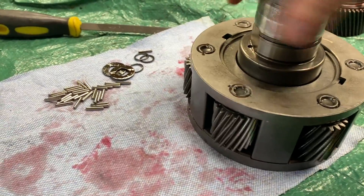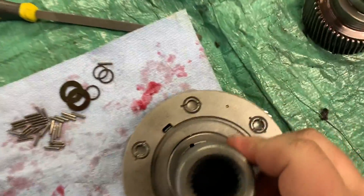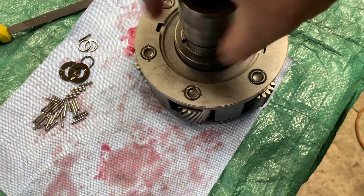And there we have it - a six-gear planetary, all built. That was pretty simple. A six-gear planetary can handle a lot more torque than your stock three-gear planetary. So if you have accessibility to another planetary or transfer case where you can salvage parts and you have a press, follow along these steps and you'll be able to build one. If you have any questions or comments, post them below. Subscribe because we're doing an LS swap right now, and after that I'm hoping to get into a Cummins 4BT JK build. Talk to you later!